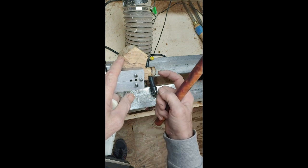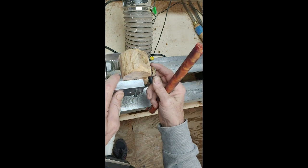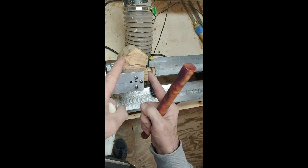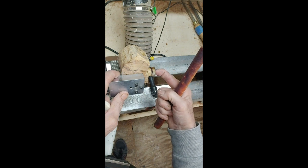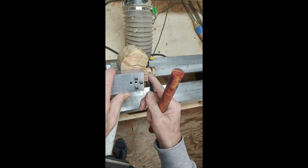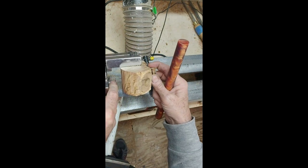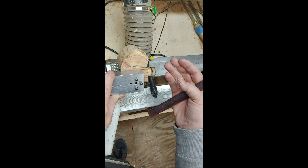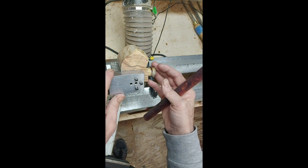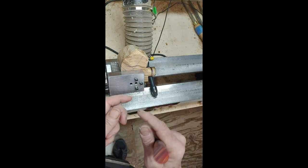I think I want that because this is going to have a bend to it. This is pretty dense, so it's going to be a little bit heavier. I have to maintain the size of this so that it's in proportion here. I've got a pretty big bore in here, so I want to keep a decent amount of material on the shank for the strength. So I can't cut this down too much; it has to remain proportionate. I'll do the best I can to reduce the weight, but in the end, I'm going to have to have really good solid balance in this so that when you're clenching this pipe, there's not too much weight on your jaw. It'll feel comfortable. So I'm going to go cut this down, and we'll get this all set up.